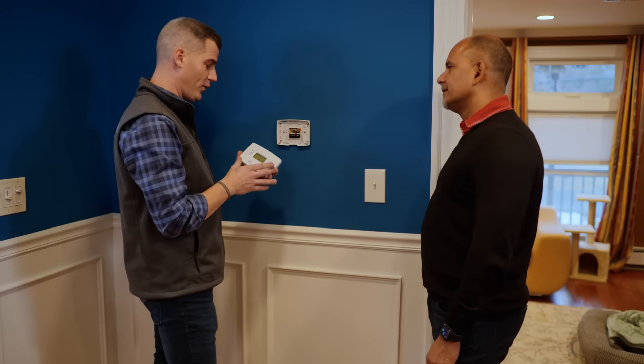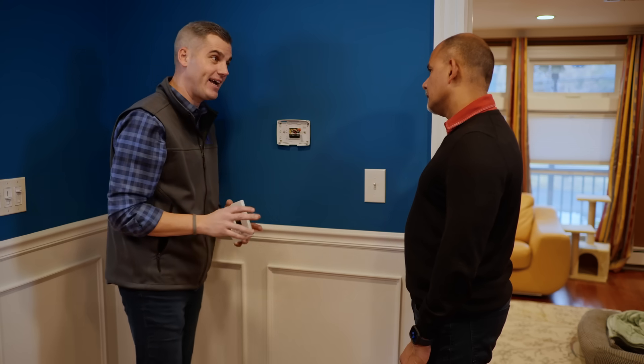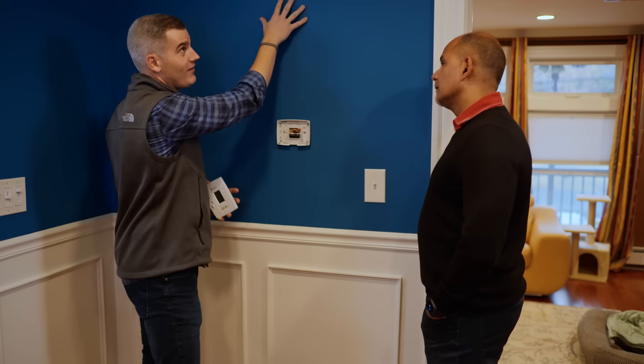Let's do a quick recap. With your old thermostat, you didn't need a continuous power source — you ran the old unit off of batteries. The batteries worked just fine because they only ran a clock, so it didn't need a lot of power. The new smart thermostats need 24 volts of constant power, so without the common wire, your smart thermostat would deplete batteries really quickly. We have a couple of different solutions. The first one is to find the splice — but that's like a needle in a haystack; I don't recommend that because we don't know which wall cavity it's running in. The next solution would be to run a new wire from this thermostat up to the attic, but that could also be really challenging getting through two wall cavities.